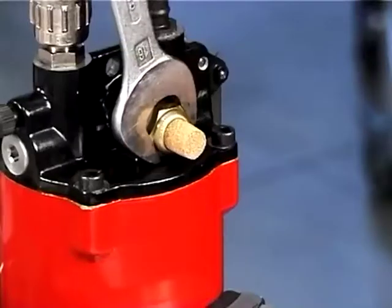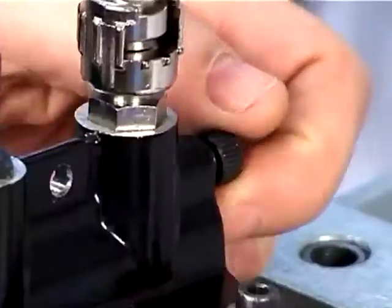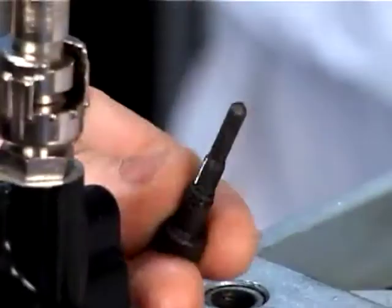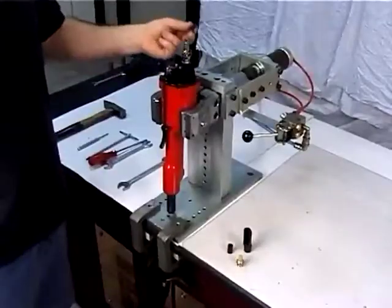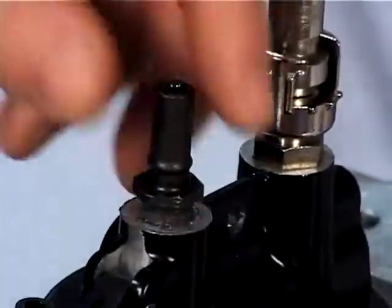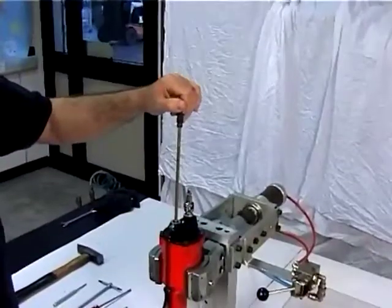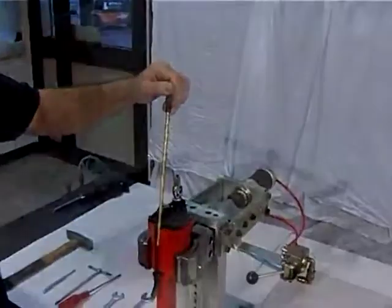By means of a 16 mm wrench, remove the silencer, figure 53, then unscrew the suction adjustment knob and take it out, figure 14. By means of a 16 mm wrench, unblock the connector, figure 9, and take it out, along with the air conveyor, figure 50.